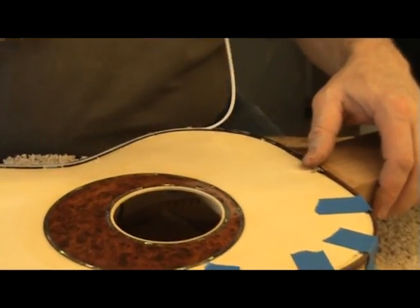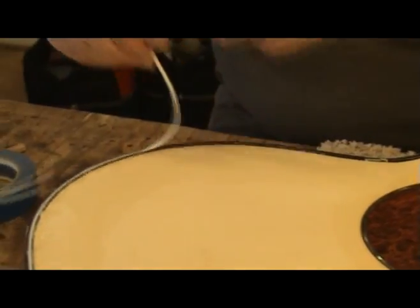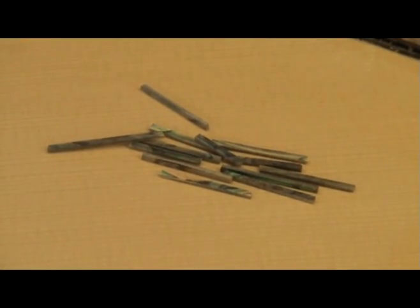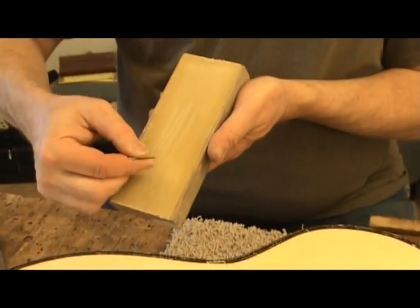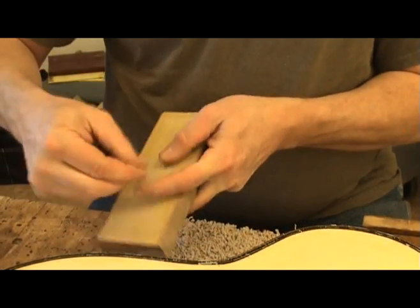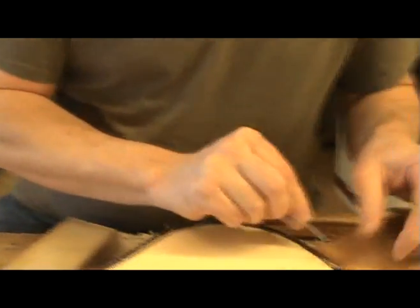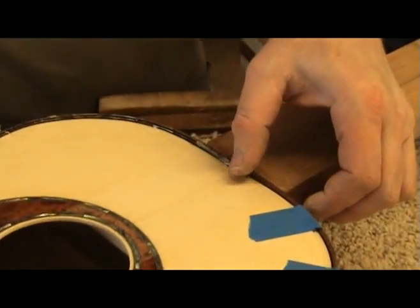After the glue used to hold the bindings is dry, then just remove the Teflon strip. The next step is to fit the abalone to the channel. One way of doing this is to sand the ends of each piece of abalone square. You can then place it in the void created by the Teflon strip that you removed.